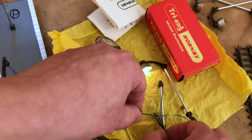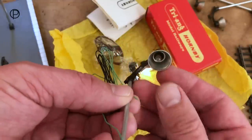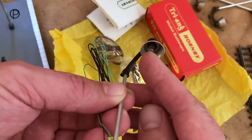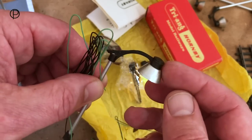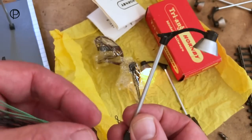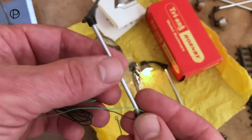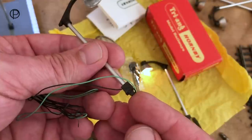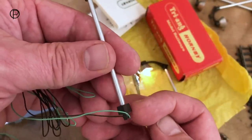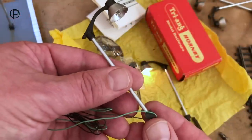Just have a look at one of these lamps which isn't lit up. They're very simple things. We've got the glass sort of filament-type bulb in there — a cartridge bulb that just pushes into the top. We've got two wires into the lamp. Both wires don't run all the way up the lamp — just the black wire does. The green wire just makes contact with the shaft of the lamp in the plastic housing there, so it forms the return path.